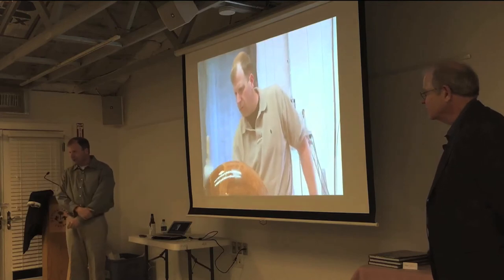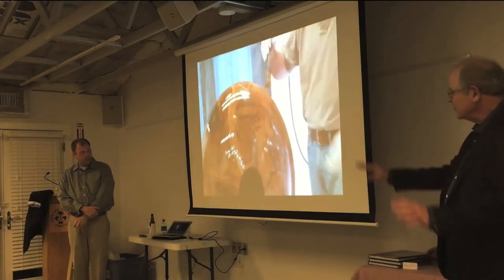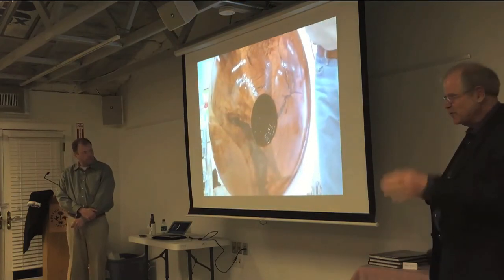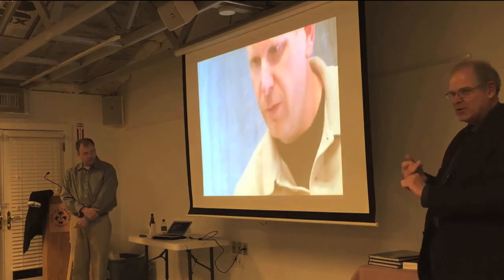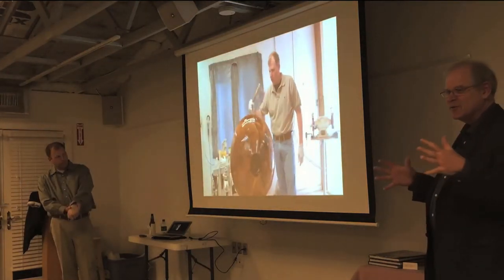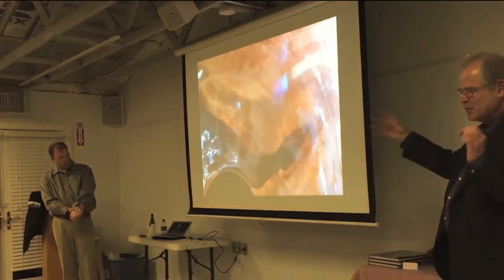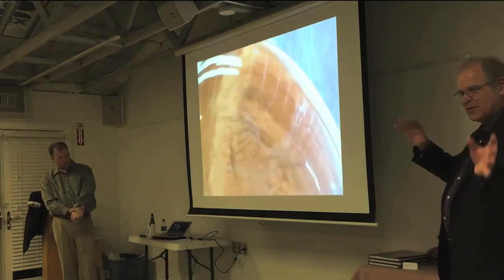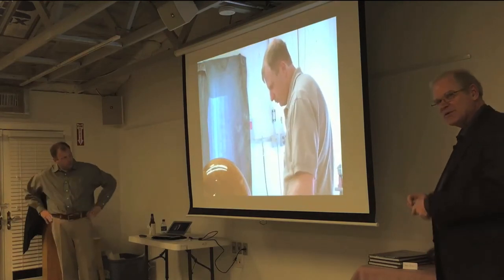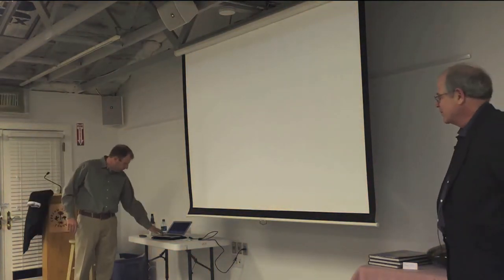So what is that material you're putting on there now? This is applying the finish. This is after it's all been thinned down. It's gone through this whole sanding stage where it's really smooth. We'll start with a thinner coat, and it's an epoxy type of finish. So it's mixed up, and it doesn't really dry. This actually chemically sets. What he's doing is actually after it's had 2 thinner coats before this. Once we have a couple thin coats underneath, then we start putting thick coats on, and each one takes a day or so to set up enough so you can start working on it again, re-sand it, and then re-coat it again. So it's got 2 or 3 of these final coats on there.